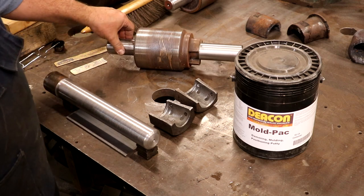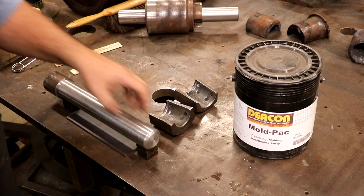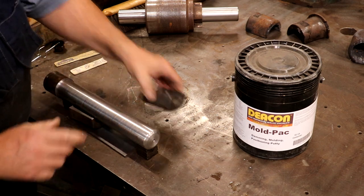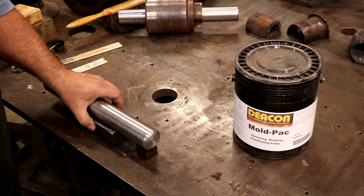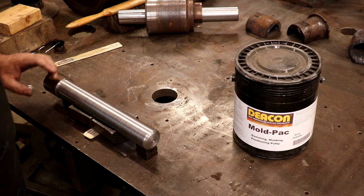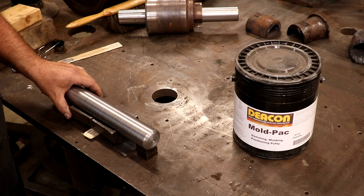When we take them off of here, they should fit right on this shaft. I've got this shaft set up over here sitting on a couple of V-blocks. I'm going to position our bearing caps underneath this. Because one side is tapered, we've got a piece of metal picking it up — there's nothing real precision about this; the bearings can be as thick or thin as you want, you've got plenty of adjustment. I'm just going to use a little shim underneath here — a little piece of wood — and I've eyeballed it. It's level enough, and we'll position these with an equal amount on each side.